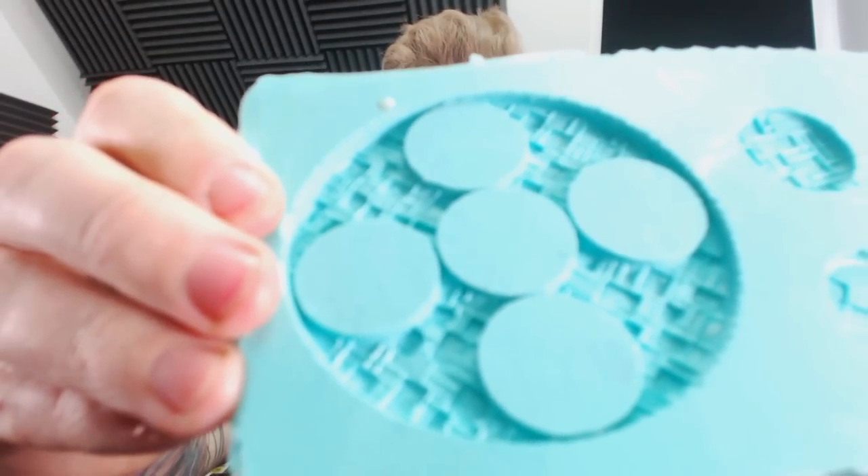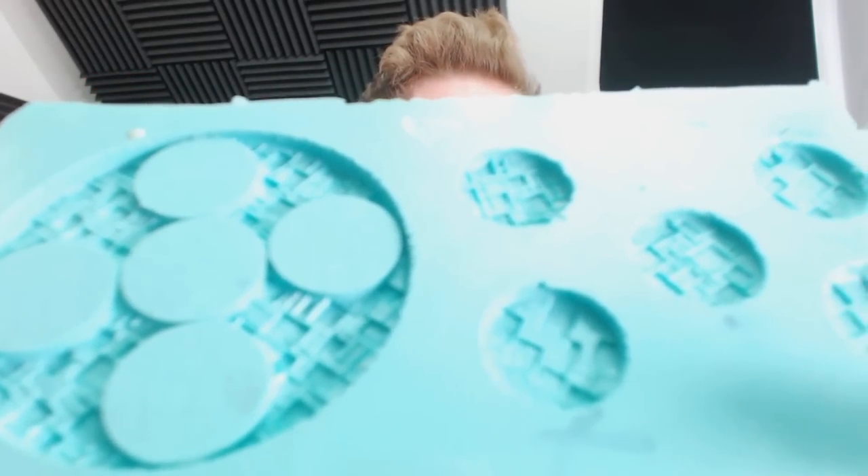As long as you follow the steps in the video, use 5%. If you can't work it out, just type into Google — say you've used 300ml — 'what's 5% of 300ml?' If you can't do that maths, you've got a computer that can do it for you. The high pour is what you need to do for home basic moulding — it gets rid of all the air bubbles. As you can see, that's a lovely clean mould — no air bubbles — and that's just because of the high pour and a little bang on the desk.